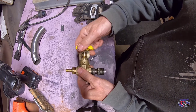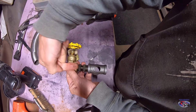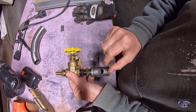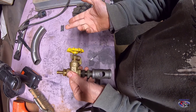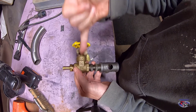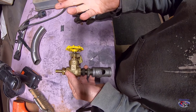With that rivet inside the center of the gate valve, it tightens up in there really well. Then you can go ahead and regulate this — once you screw your pipe tee on there, you can see the oil flowing through it. You can see a slow drip, a faster drip, or a steady stream. As you open it up, that stream goes from a very thin stream all the way to a full thick one with the gate valve open all the way.